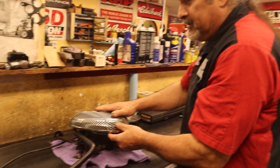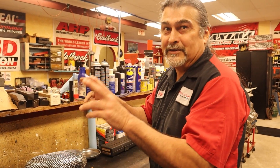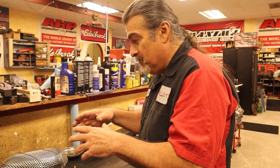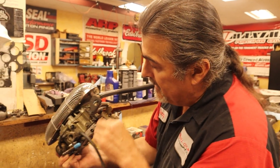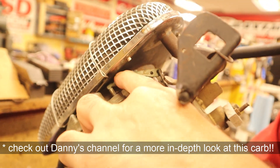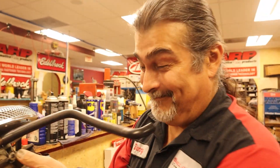Another reason he wanted to do this also: normally thou shalt not get air from under the hood — Gail Banks, right? But in this particular instance, thou shalt get air from under the hood. We want the hottest air possible for the hot vapor. That is just not even a patch job — that is actually professional. And he clearanced that accelerator pump to clear that air cleaner. See how tight it is right there? He had shaved it. Now we know why he shaved it.